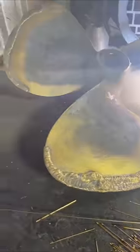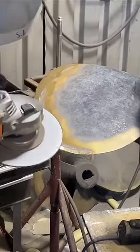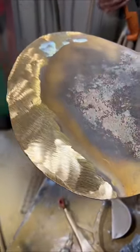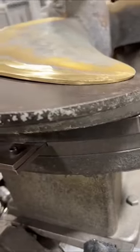We agreed to, and I really wish we had taken a picture beforehand, because one of the blades was sticking straight up. So we had to put it in the gantry press first to get it straight. We then put it on our TrueProp software to verify that the blade spacing and the chords were good.